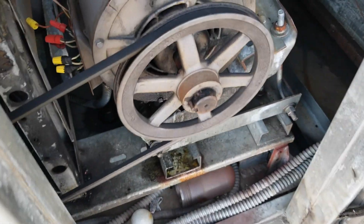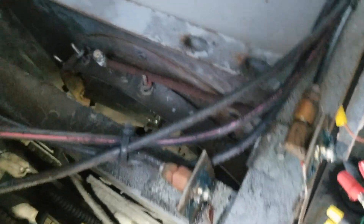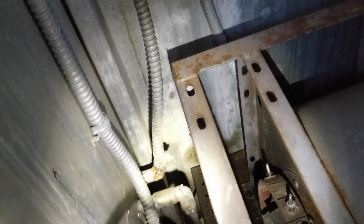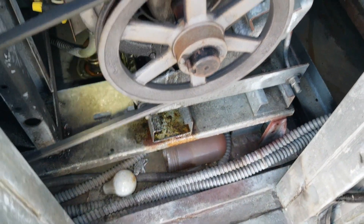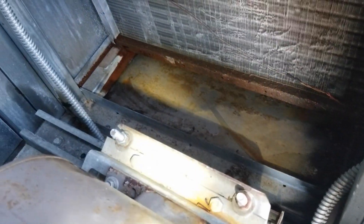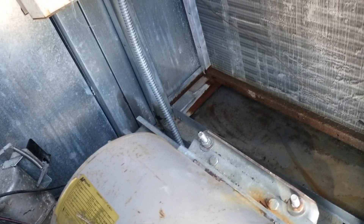This is inside the compartment nearest to where it's dripping — the corner it's dripping out of. It's dry in here. So wherever that water is, it's not in this compartment. There have been problems before where the whole pan here would get wet and there's a drain back there that's not right, but it's surprisingly dry. Condensate pans are catching condensate like they should and don't appear to be leaking. Condensate is coming out the drains like it's supposed to, so I don't think that's the problem. It's just holding water somewhere where it shouldn't.